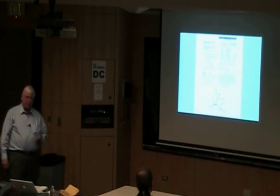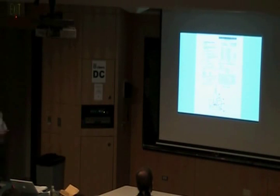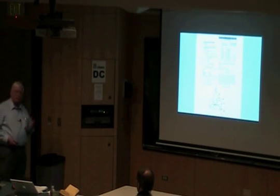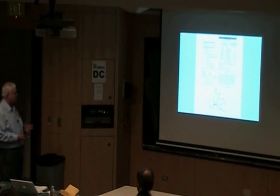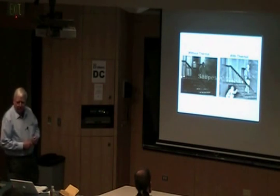And now we come to the new patent for manufacturing this stuff, and we're just going to make it. This was patented in September '09. It's got a number if you want to copy it down. Basically, you have a plunger and an anvil, and you put powder in between and squeeze the heck out of it, and that makes it a solid. There are some powders that work very well for this. The one that's preferred by chemists for the last few decades is potassium bromide, and they use it for a measuring technique. Now this shows it being mounted, being compressed into another kind of cell. I'll give you more definition in a moment.